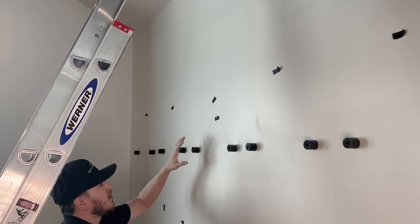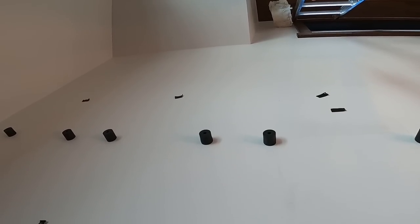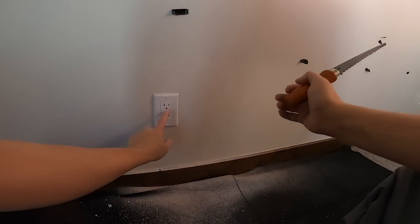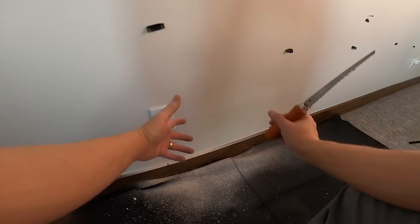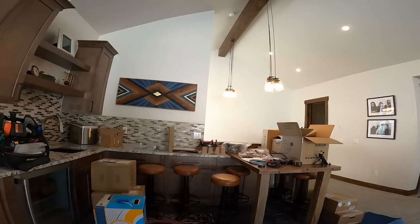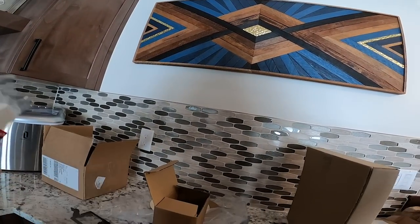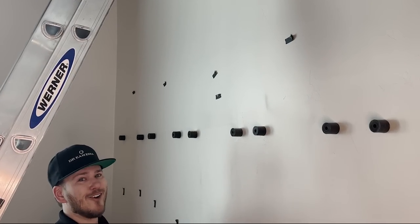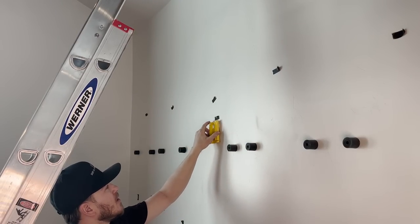I've marked where the stud is on the wall, and looking up I'm directly in line with my hole up there — so this is where my fish rod hit. I'm going to cut a single gang hole right here. Single gang means one single outlet. There's also dual, triple, and quad gang, but I'm going to use single gang because I have retro boxes that'll allow me to bring wires in with a retro ring and a plate, which keeps everything clean. You can get the single gang template from Home Depot or Lowe's — it imprints the correct outline on the wall.